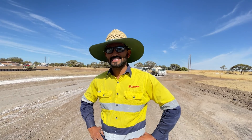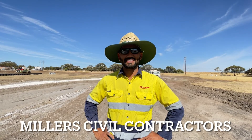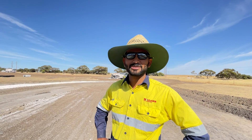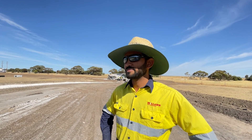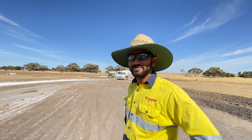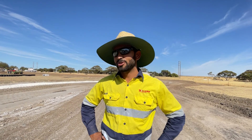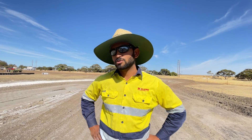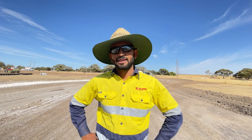We're here with Roo, civil engineer for Miller Contractors and also the project manager. Can you tell us what's happening today Roo? Yeah, we're just stabilising the track today so the go-kart track club can go faster on the road. We're going 250mm below subgrade level and stabilising the whole layer with the lime. We're struggling a bit on the curve at the moment, but we'll be alright. With the reactive clay we've got here, stabilising has proven to be successful. This is going to help us improve things as we're doing it below 250 level, then we're going to put class 1 material on top of it. The lime is going to help to improve the ground.